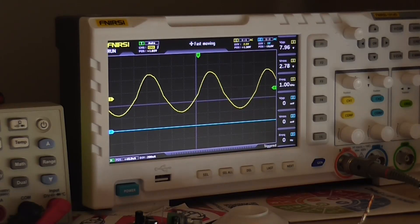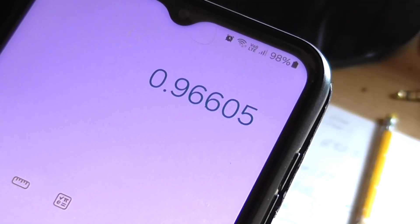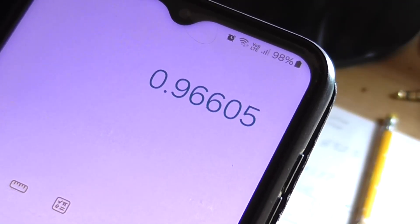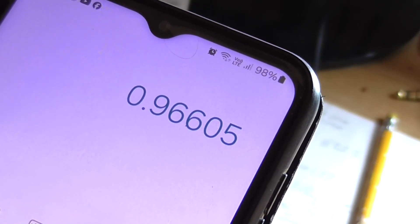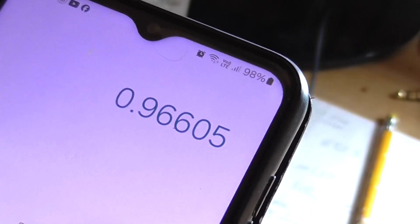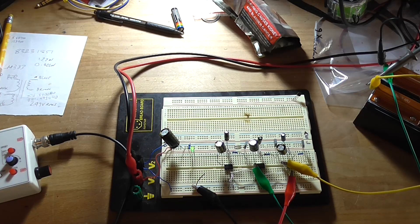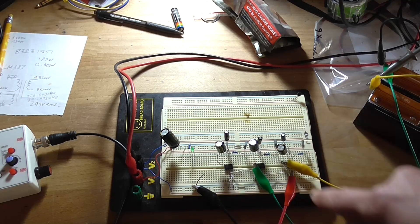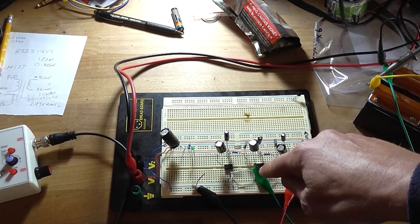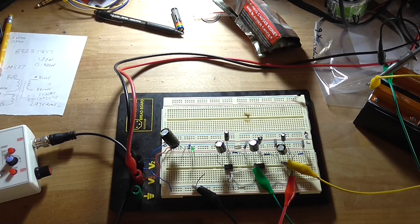So far it doesn't look like this is a very practical solution. Calculating the power — 966 milliwatts, about 200 to 300 milliwatts short. It's going to sound fairly imbalanced. I'm going to kill the power and reconfigure the circuit so that we've got a load on each side with the amplifier centre point as the common point of both. I want to see if there's a phase shift between the two signals.